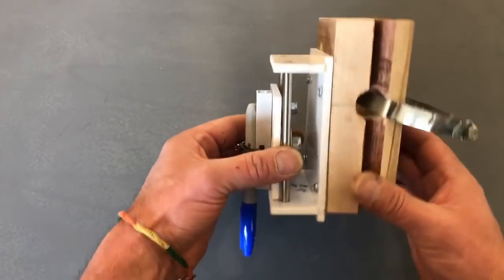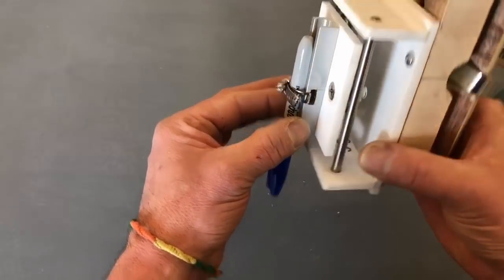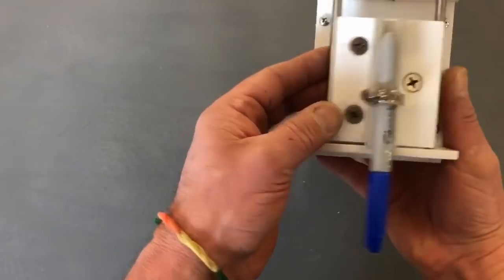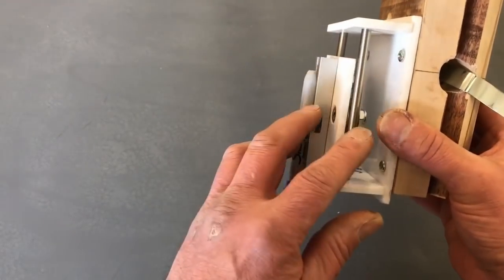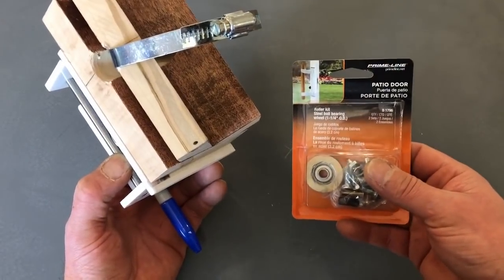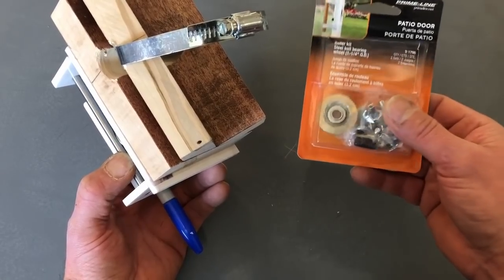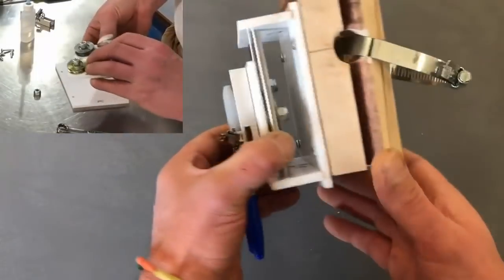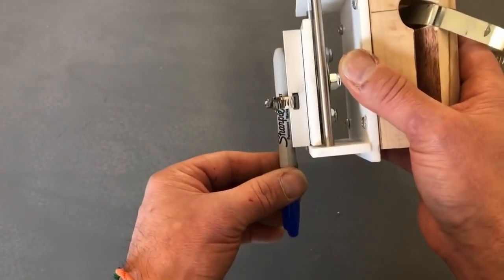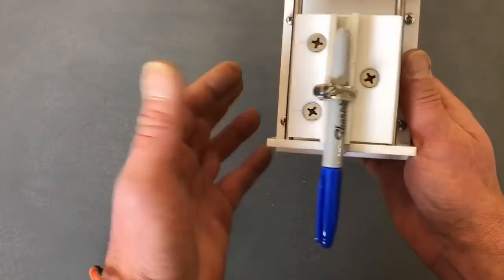This next design is stepping up a level. It operates on a slightly different principle — there is no spring. It floats by just the gravity and weight of this head sliding on a couple of rails with some ball-bearing guides — I have three of them. This is quarter-inch round stock with bearing guides. These were left over from a patio door repair — they sell these at Home Depot, any hardware store. They're pretty junky bearings, not very precise, but they do work. In the future I might be rebuilding this with better quality bearings to get a little smoother action.